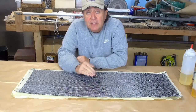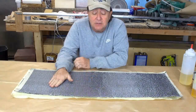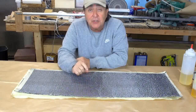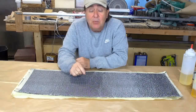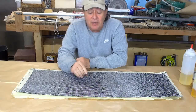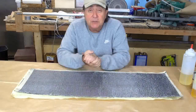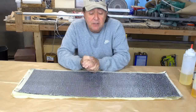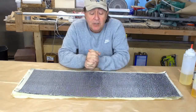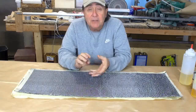So we'll be cutting the weight in half on the composite fabric, which means that we cut the weight of the resin in half, almost. There's resin that goes into the foam, that adds a little bit back in. So the tubing's not quite half the weight, but close. And I'm going to make 2 samples, same length, and I'm hoping I can use both of them on the glider somewhere. If not, that's okay. I'll just make more tubing, but I'll be able to test them.